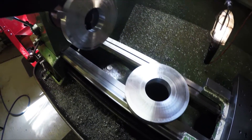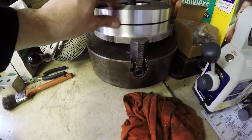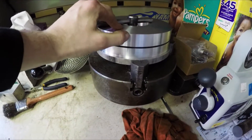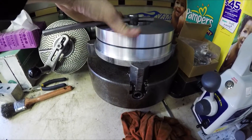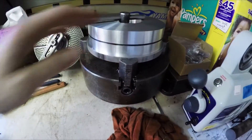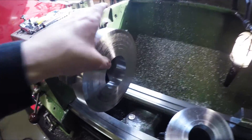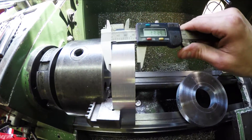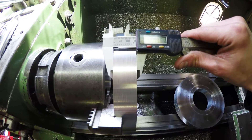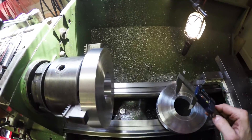I've got two of the blanks parted off. The other ones are sitting over here. I ended up snapping the parting tool, so I took the whole chuck off and left it mounted that way so I don't have to zero it back out - it's exactly the way we left it. Got my three-jaw chuck in with this guy mounted. I need to face this side and bring it down to one inch - need to take off about 96 thou.